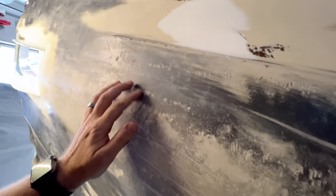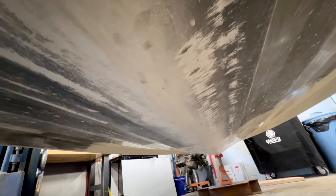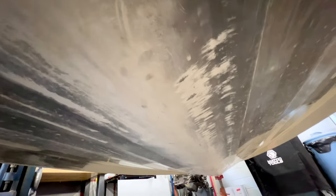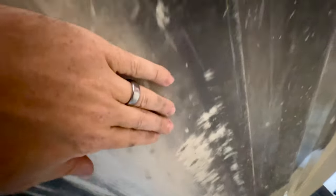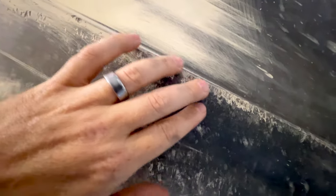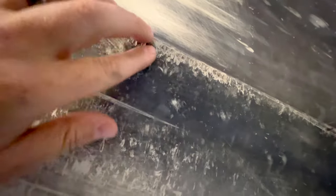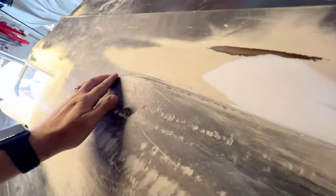I kind of figured I have access now and I want to see what I can do to make all this better and improve it, although I don't want to go crazy and try to restore the entire bottom side of the boat right now. I'm looking for a good compromise - kind of an economical fix, economical in terms of both cost of materials and time invested. So the first step for anything that we need to do down here is I need to get all this stuff prepped. I'm going to take a Dremel with a carbide bit, knock out any big loose chunks, then grab some 80 grit, get everything sanded and prepped. We'll worry about the speed coat last because by the time I'm done sanding and grinding the speed coat will be gone and we'll get that out of the way, and then that will have us set up for the next steps.